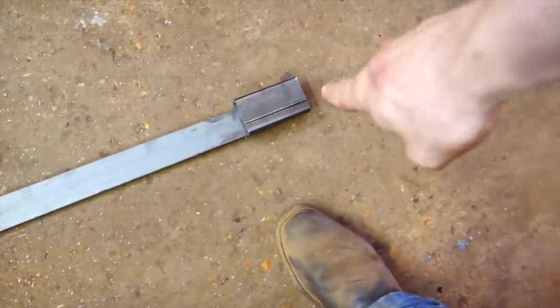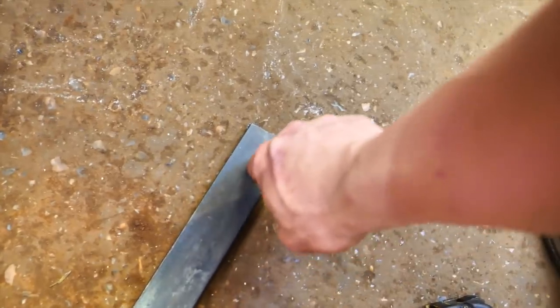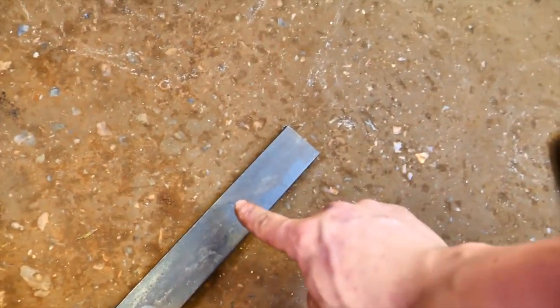Let me explain my concept. The locking bar will be received in this piece of rectangular tube. That rectangular tube is going to be welded to a little piece of this plate. This bar will continue along the entire length until I mill a slot in this bar, make another plate, and make a thing that sticks through this hole that'll accept the padlock. Seems easy enough.